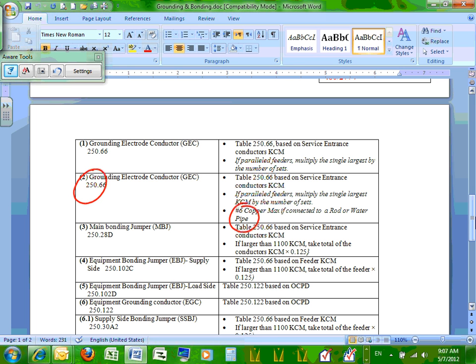To the bar. And actually, if you go to the switchgear directly, the same thing applies to it. But highly unlikely in a major building, guys, you will never go directly from a ground rod into the switchgear. There is a grounding bar that you tie multiple ground rods going to that bar, and from the bar you also ground the steel of the building, the water, anything electrical, and then from there you take one going directly into the switchgear.